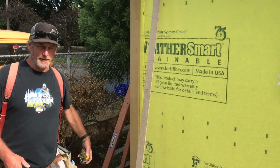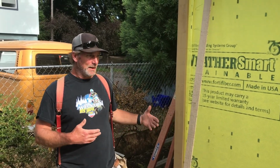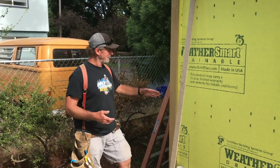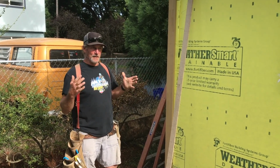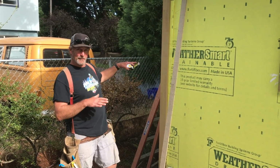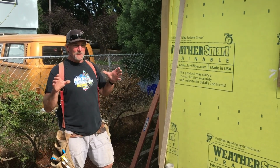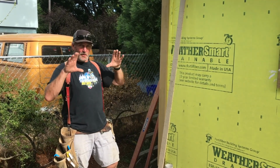The other question you come up with when you're going to start siding is where's level? How do I establish the same point all the way around the house? Well, there's a couple ways. You could get a laser or transit out here or some leveling device and plot a point all the way around the home to have one basic starting point that you know is level. I want it to be consistent. If the home happens to be an inch out of level from one corner to the far corner, I'm not going to try to fix that with the siding. That would look really weird. And keep in mind, those are the things you see. Something out of level with something level on the inside of it, you know it looks screwed up.